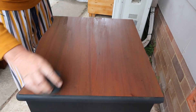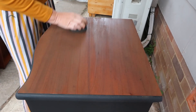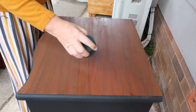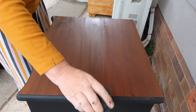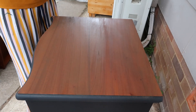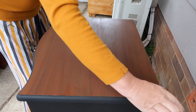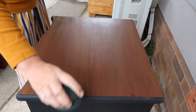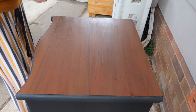As I'm going over it now I'm seeing more brown, so I don't want to do too much because I'm actually liking the red that's in it. A lot of that red that's come out will be the natural color from the wood — even if you just rubbed a wet cloth over it you'd see that red, there's no hiding it. So I don't want to go too much with this because I want to keep this red. I'm really really happy with that. Okay, let that dry and then I'll come back and do the top coat.